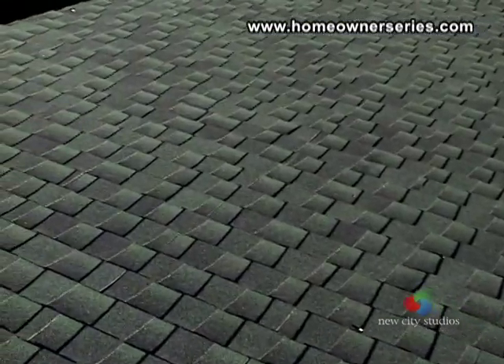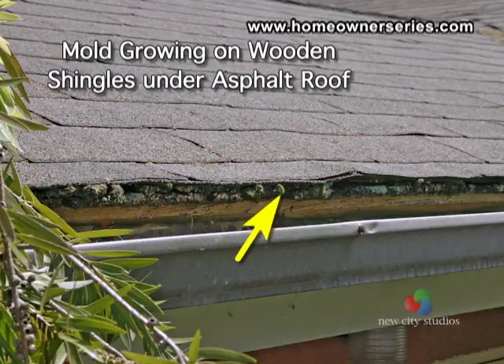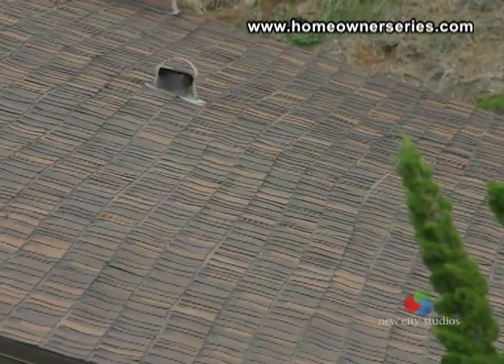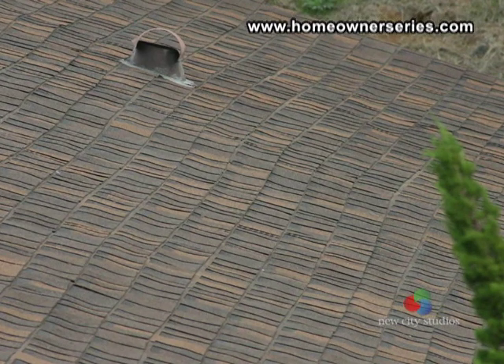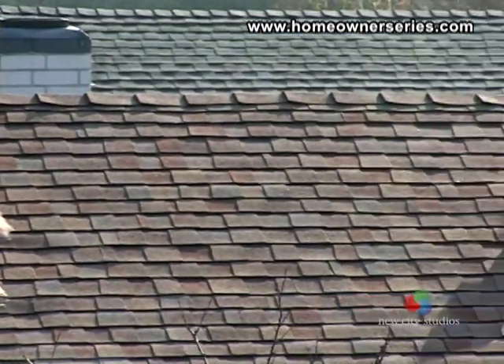Keep in mind that this roof can be installed over top of an existing roof. This should not be a problem unless both roofs together create such unevenness that water does not drain properly. On this roof, the asphalt fiberglass shingles were installed over top of a wooden shake roof, and you can tell that there is a lot of unevenness to the overall layout. On another roof, the wooden shingles were nailed down tightly so the asphalt fiberglass roof lies more evenly.